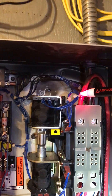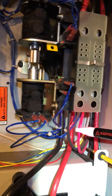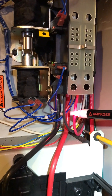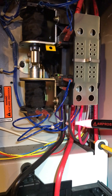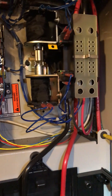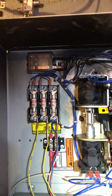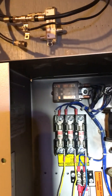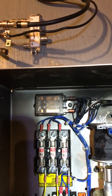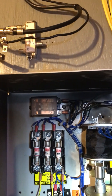There it goes - back to utility power. I don't know if you can see that red light or not. The generator is still running so it's still red, but when the generator shuts off it will go out. That's back to working and that's all I really care about. That relay up there got pretty dark - I was worried about it. The wiring was heated and blackened but the wire actually survived.